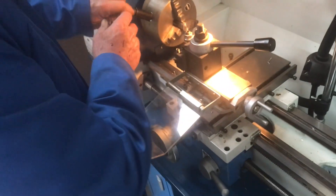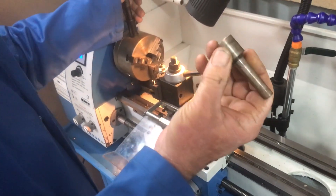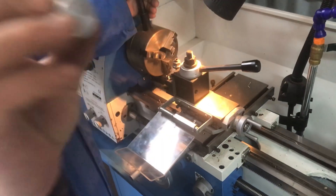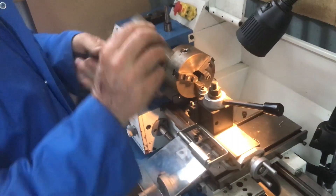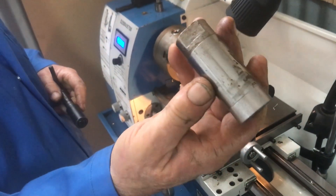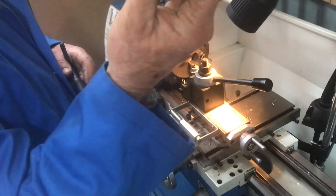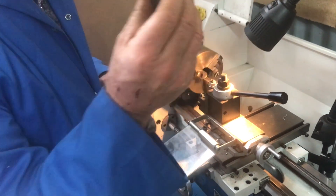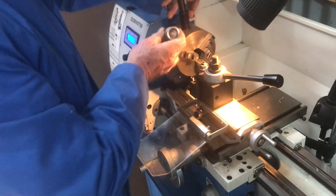I've got three different types of steels here. This is high tensile steel — if it cuts high tensile it's going to cut mild steel. This other piece is very tough steel, actually a pull piston from a hydraulic unit — it's like ball bearing steel, very hard but not hardened. It's more like tool steel.